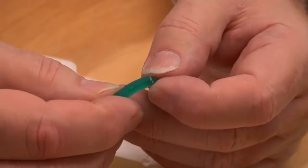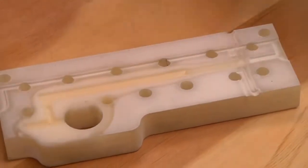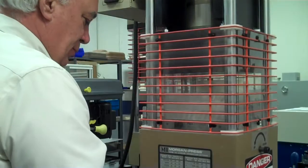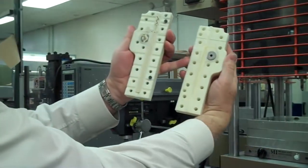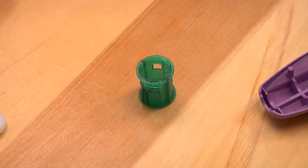The customer doesn't have to make concessions in his design, doesn't have to cut corners, doesn't have to wonder whether it really would have worked another way. They didn't have to make adjustments or modify the part. These printed molds — we clamp with about four to five tons of pressure so they don't flash. We don't have to trim parts when we're done. We pull them out of the mold and ship them.